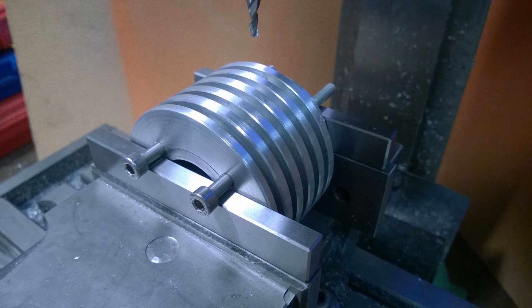Because this is a billet construction — all out of solid extruded aluminium — I don't have the luxury of casting passages. So we basically have to come at it another way. All I'm going to do is make a passage and drill a hole that goes from the exterior of the cylinder through the actual sleeve to the interior of the cylinder. Anyway, let's get on with it.